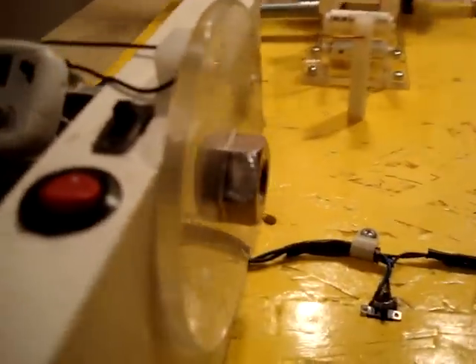I've also changed the mechanism for how I hold my coils on — this is all steel now. It was PVC before, and when you're winding a lot of coils, the PVC can get loose. So I changed this to steel. It's just a couple of nuts that have been welded together, then fitted and re-threaded on the backside to accept the windshield wiper motor.